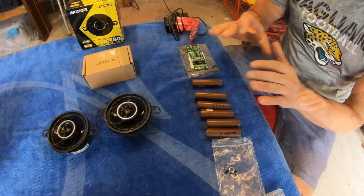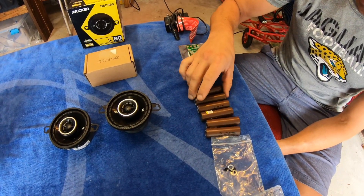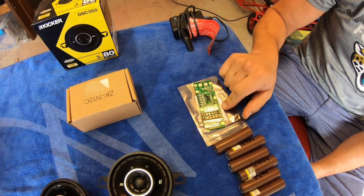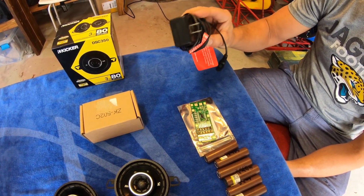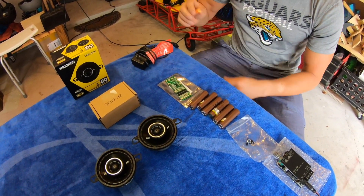You can do 12 to 24 volts power supply for this amplifier. With the six cells, we're going to combine them with a battery management system. This is a 6S lithium ion battery management system, and this 24-volt power supply is used for charging. That's the power side of the whole music assembly.